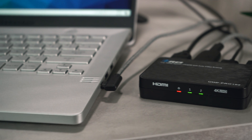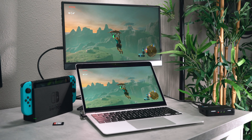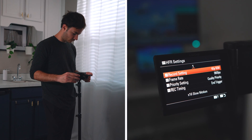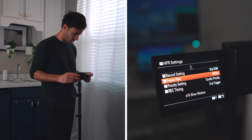There are a lot of things to consider when it comes to input latency, from the actual controller input through each device of the video chain until you see the action display on the screen — each link in the chain adds some latency. For me, the only thing I really care about is the perceivable input lag when I hook this thing up to my laptop. I'm using an active HDMI splitter with one output to a 1ms 240Hz gaming monitor, and the other connecting the Shadowcast to the computer via the included USB-C 2.0 cable. I'm capturing in-game timers at 960 frames per second and slowing down the footage to find the average time difference between the devices. This is not the most scientific test, but it should give a good idea of the perceivable input lag differences.